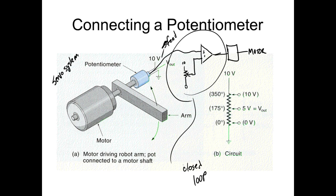So there's a sensor out there that senses the speed, right? You understand that? And then when you engage it, you're setting a set point. This is a set point. So what's the set point? I need to put that in the glossary. What's the set point on a closed loop system? That's what you establish, what you want it to do, right? You understand? And then the feedback is giving you what the actuator's actually doing, right? You understand?